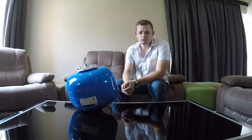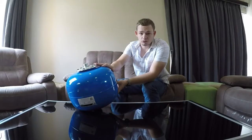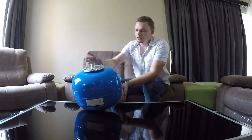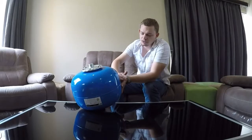Pressurized buffer tanks are a very nice solution that can be used in quite a few places, and in our experience almost everywhere you use them they end up simplifying things a lot. This is a tiny example — we offer them up to 500 litre tanks. The concept is you have a tank which can handle quite a lot of pressure, and attached inside is a rubber bladder which gets pressurized with air. When the tank is empty, as in this case, the air bladder literally fills the whole tank. You then force water in at pressure, which compresses the air, and the pressure builds up until the air and water have equalized.